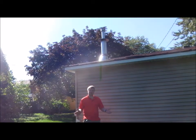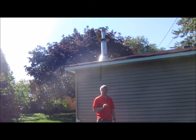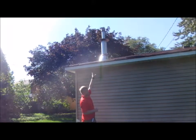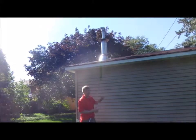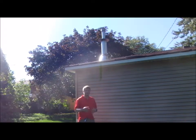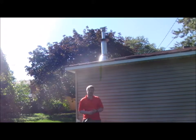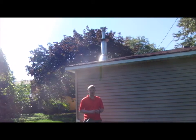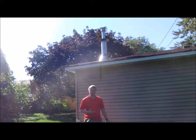Now if you're going to skip having a filter on your dust collection system and just blow it outside, there is one safety concern I want to point out — especially if your garage is heated by a natural gas heater like mine. This here is the stack to my natural gas furnace. There are two pipes: an inner pipe and an outer pipe. The outer pipe is the intake and the center one is the exhaust — it's called separated combustion. In order to heat my shop, the unit sucks fresh air from outside and blows the exhaust outside, keeping it completely separate from the air I breathe inside. The issue with blowing your dust collection outside is that it draws a vacuum on your entire shop, and if you don't have a separated combustion unit you'll actually suck that exhaust right into the air that you're breathing, and it can kill you with carbon monoxide poisoning.